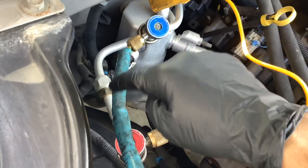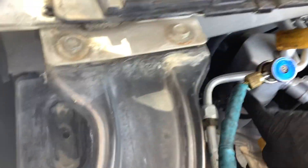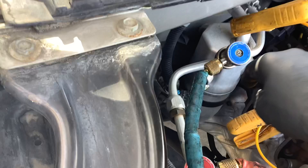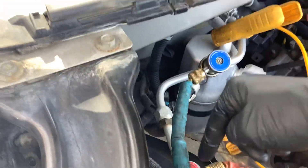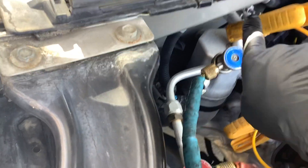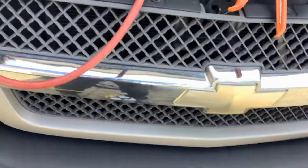I just want to get the dye out of here because when I put it back on the vacuum I don't want to suck the liquid dye that I just injected — right now it's sitting right in here — back up when I perform my vacuum after the pressure test. So by injecting right here it'll flash in a really rapid motion downstream into the evaporator as I turn on the nitrogen. So let's turn on the nitrogen.